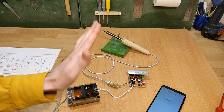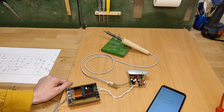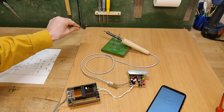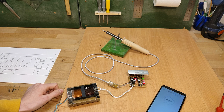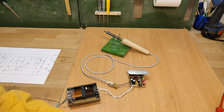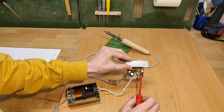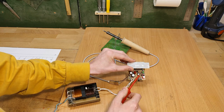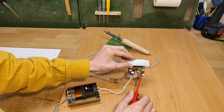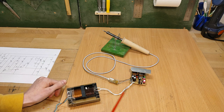It's going to preheat for about 2 minutes 10 seconds — I tested it. I believe solder starts melting at around 1 minute 30. There it is — melting solder, as you can see from the smoke. And in about 8 seconds, there it goes, it just fades out: 2 minutes 15 seconds of preheat. So now, if I turn up the variable resistor, it's actually going to be the red LED going brighter and brighter, with the green one getting more and more flickery, until lastly the red one stays on all the time and the green one goes off. And now it's on full power — 30 watts.